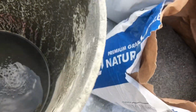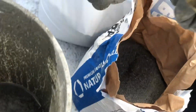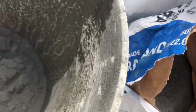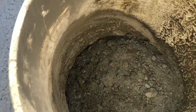got this bucket here. What I'll do, I'll put 3 to 1 basically. 1, 2, and I'll put another Portland cement. So that's the 1. And then, so that's 3 to 1, basically 1 Portland cement, 3 sand. And because I'm doing it just one batch at a time, it's kind of concentrated. Just kind of roll it like that. Get a little chocolate in there.